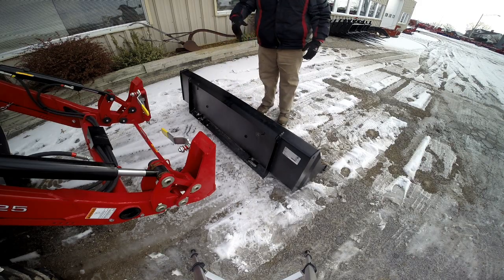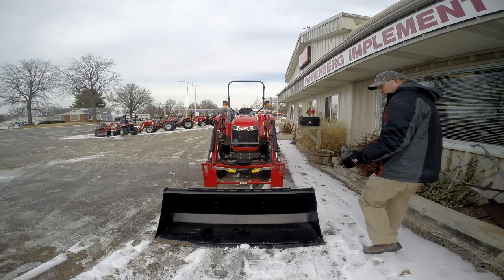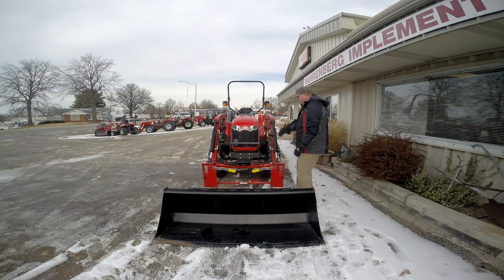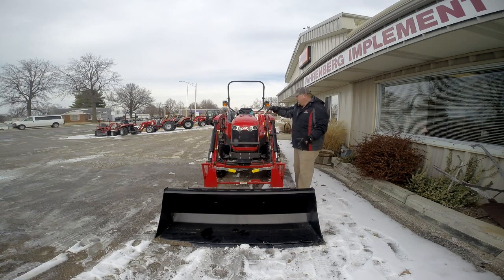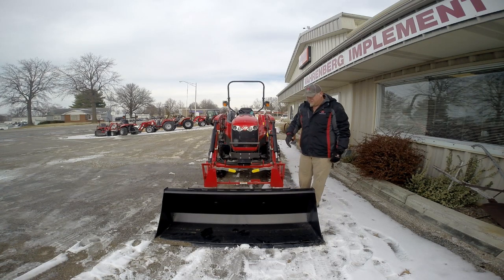What would have happened if I had lifted this? If I had lifted that loader and the bucket wasn't properly attached and had it up in the air, it could have rolled right back down here toward the operator. If you look at this, it's like two railroad tracks leading right to the operator station with nothing to protect it.